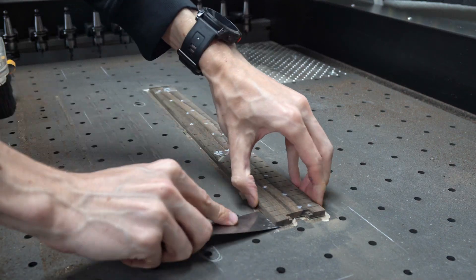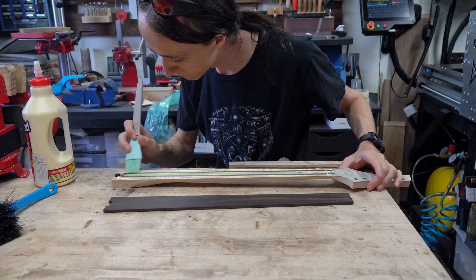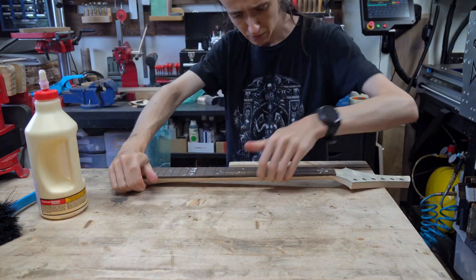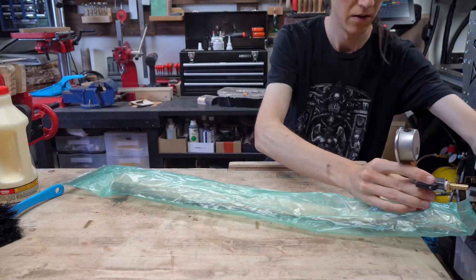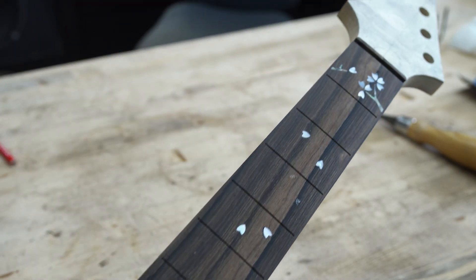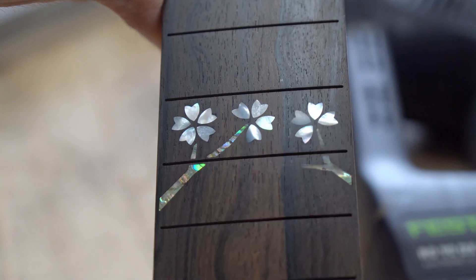I can take it off the machine and start gluing it onto the neck. I've moved to using a vacuum system for that — I use vacuum bags typically used for composites, which I only get two or three uses out of, but they let me create this tube-like setup that allows me to very easily install this fretboard and get even clamping pressure all around. Using this method I no longer have any issues with gaps, and I get perfect adhesion everywhere. After the fretboard is glued to the neck I take a leveling beam to make sure it is perfectly flat, and then a radiusing block to make sure the radius is perfect. This is when the design really starts to look beautiful.